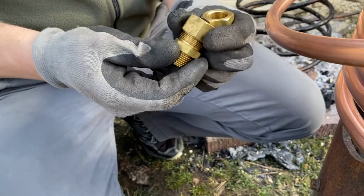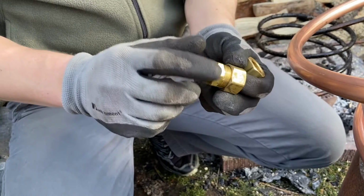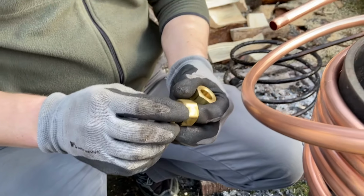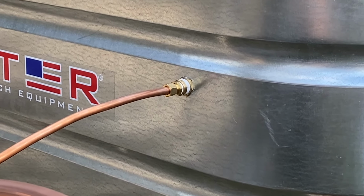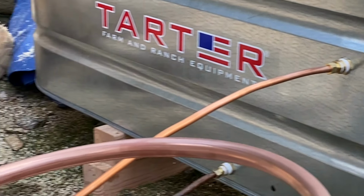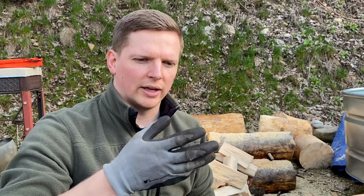So these here actually work perfectly for us. They work with the tank pass-through or cooler drain. It's a bulkhead technically. Cooler drain or bulkhead fittings that we got that pass through the tank. Those bulkheads happen to have 2 threads, one on the outside for a normal hose, like garden hose fitting, which is a 3/4 garden hose thread, and the inside thread on those is a 1/2 inch iron pipe thread.